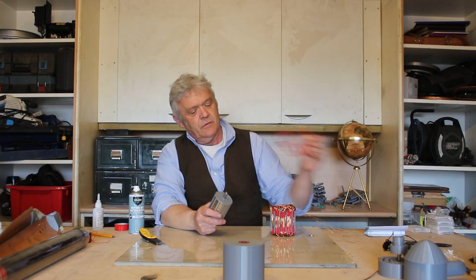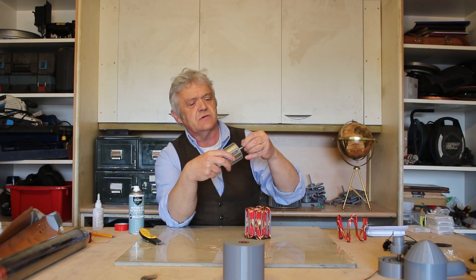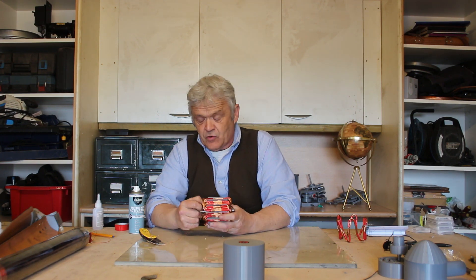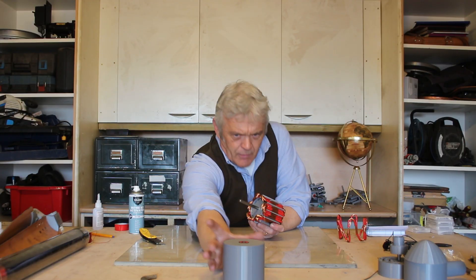The serpentine coil is super easy to make — that's one of the other joys of it. Winding 12 individual coils and then losing half the copper is depressing and takes forever, whereas winding one serpentine coil takes no time at all and you don't need half the copper. Our rotor fits in with an 8mm washer spacer to make sure it spins freely. This is a work in progress, so I'm not making the Tinkercad files public just yet, but once I get the lengths right I'll release them. Then we just pop the cover on, give it a spin, and it'll generate.